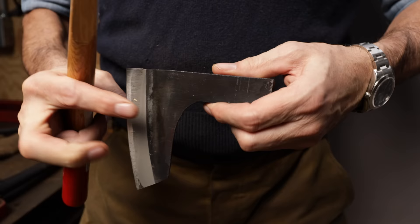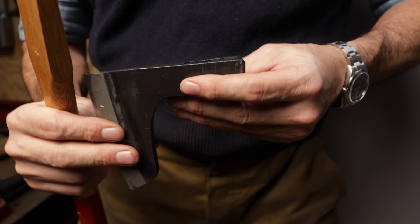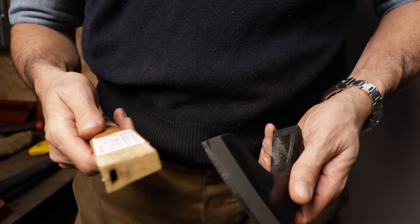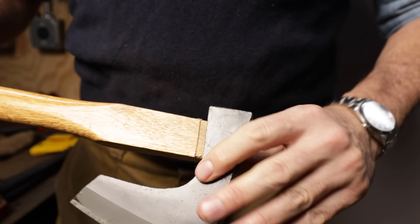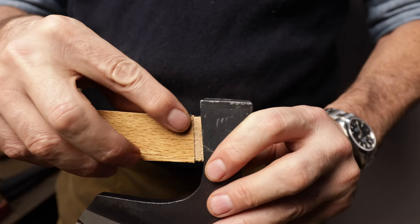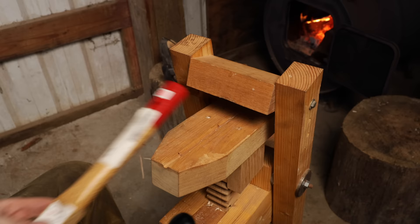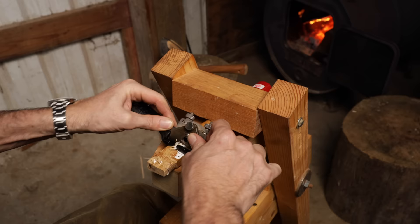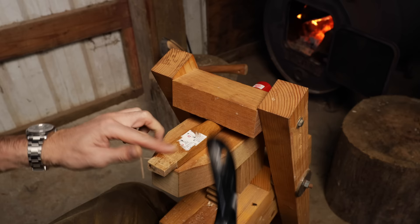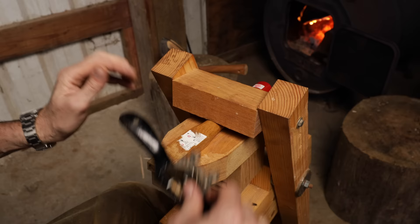So here's the axe head — it is beautiful. It does have a taper in there towards the front at the handle, and that fit can only go one way, so you can't mix the handle up. Let's taper that shoulder so that when it comes up hard against that, at least there's something holding it tight against the side and it's not just bouncing up and down on that ledge. We'll use the spokeshave and just put the slightest taper on that. We don't want to take any of that wood away, but I don't want to feel any ledge there either, so we can drive that down. Whatever wood they used, it's a hardwood for sure.